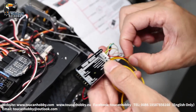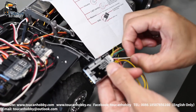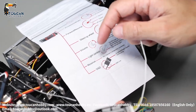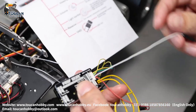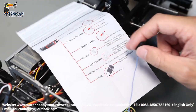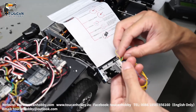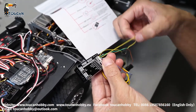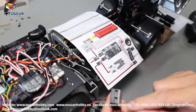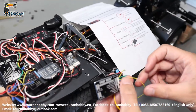Second one downside — the red one — is not available, no function. Downside third one — the white one — that's light control. You connect to receiver for light control, on condition the light system is already plugged to this downside one. So number three. Downside is the blue one — it is volume control. You plug to receiver and set up a switch — that's the volume control. And in the middle, this yellow one — that's for steering. On condition that you connect the steering servo to the top plug. This one is not connecting steering to the soundboard. So that's for steering.